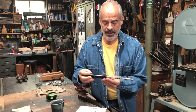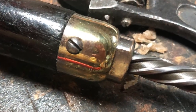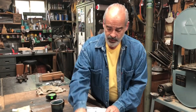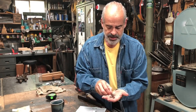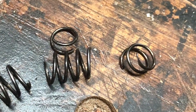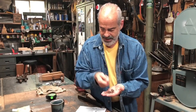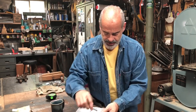I polished and cleaned it up, then removed this screw and the ferrule, and unscrewed this section. What I discovered inside were pieces of spring that used to be in there — they were brittle, broke up into little pieces, and wedged in there. I had to dig them out. There was also a little t-bolt inside.